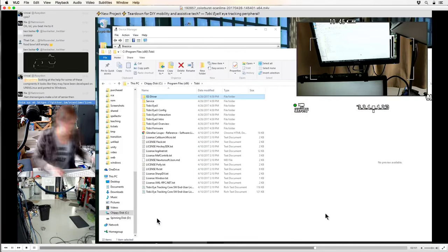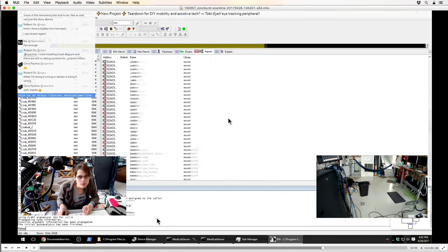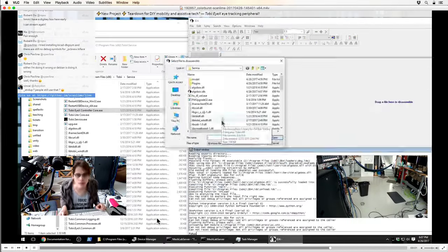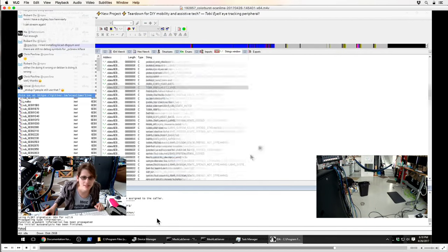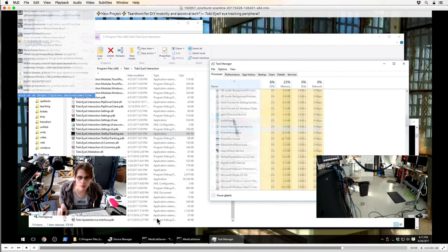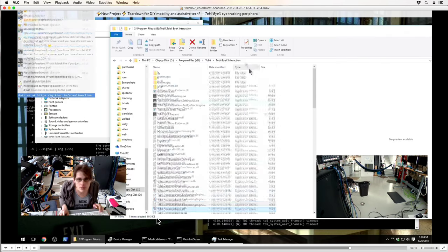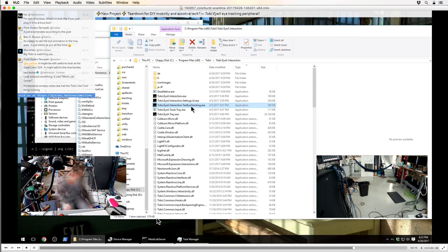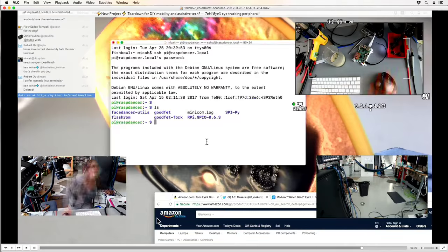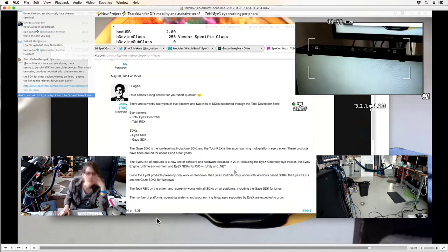And then their software actually consists of a whole network of little components. There are components that just handle user interface and controlling the Windows environment with your eyes. A lot of stuff written in C# to handle that. Then it looks like some daemons written probably in C++ to actually handle the eye tracking algorithms and the video drivers. And those were actually multiple pluggable components with basically a user space video driver in one process and a user space tracking algorithm in another process and a coordination daemon.